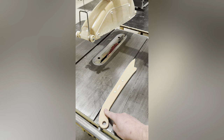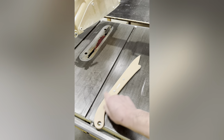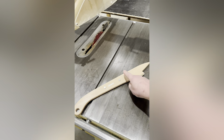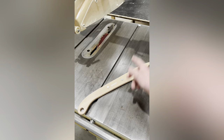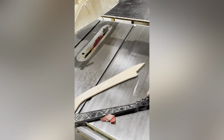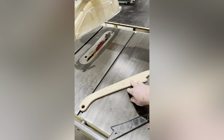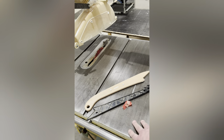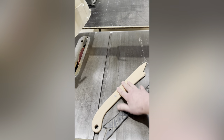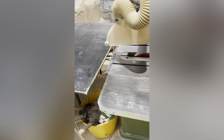This piece is probably the most important — it's a push stick, used for pushing timber through. You don't have to buy one; you can make one. This is a magnetic one, which is really handy because you can stick it to the frame above. You can also get cheap plastic ones like this. In the UK they have to be a minimum of 30 centimetres long. I don't know what the laws are in the States and other countries — maybe you could tell me in the comments.